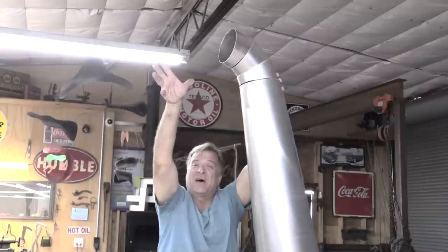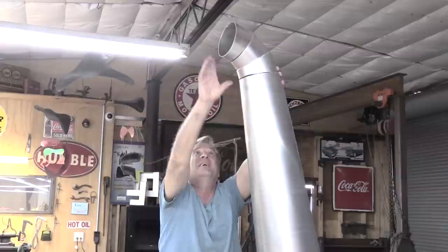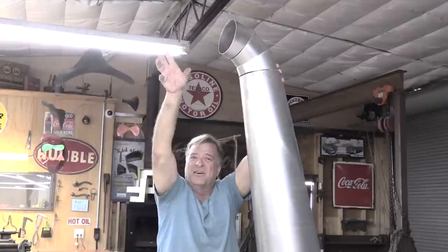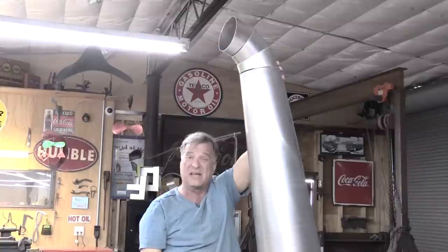It's getting smaller as I go from 6.875, which is 6 7/8, and going to drop down about a half an inch, I think, you know, maybe a quarter of an inch from one section to the next. Bring it around, end it right about in here, and then I'll roll another tapered tube like I did on this side, and from here, and bring it down. And then I can add my 4 branches to the bottom of it so I can put my flowers on it.